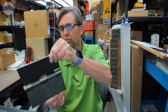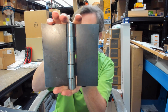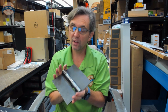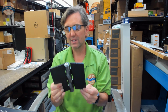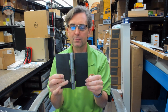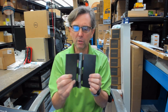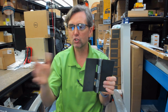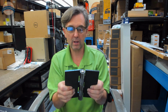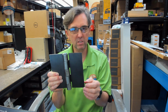This video is to bring you a closer look at the Hager 1850 6x6 plain steel welding hinge, full surface, standard weight. It's an unusual hinge, but it's a typical type of hinge in the sense that it's plain bearing and something that's going to be used in a weld-on application. So if you're building some sort of a gate or a structure, it might be an enclosure where garbage cans are kept on the outlot of a fast food restaurant. Maybe a residential gate. I wouldn't necessarily recommend something plain bearing, but if it was going to be more industrial in nature, this is a typical hinge.